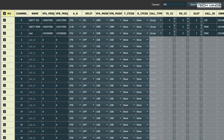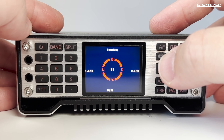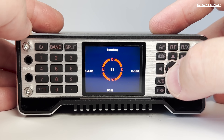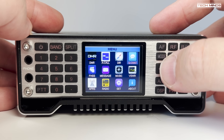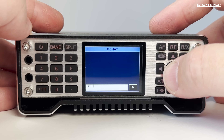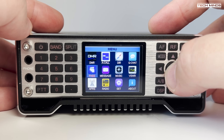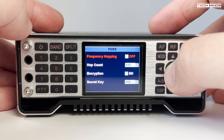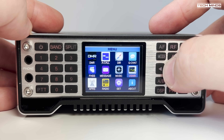If you have the compass module installed, the compass screen will show you details from the GPS. Unfortunately this data is not used outside of China — in China you can install a mobile data SIM and send position data to the APRS IS servers over GSM. It's not clear why it won't work in Europe or the US, but it may have something to do with the GSM module.